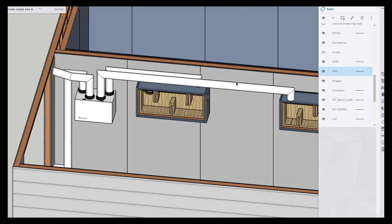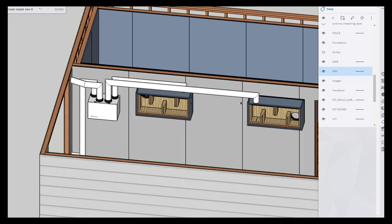I envisage this as flex duct. Flex duct's great, cheap, although there are a number of issues with it. I won't go into that, but one of the issues in this garage is, think of this as wet noodles, floppy. So to make it nice and clean and neat, you have to think about hangers and how that details out, because this stuff won't stand up on its own like it does right here, nice and pretty.